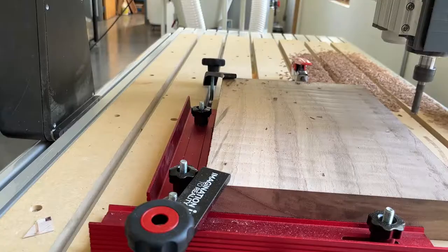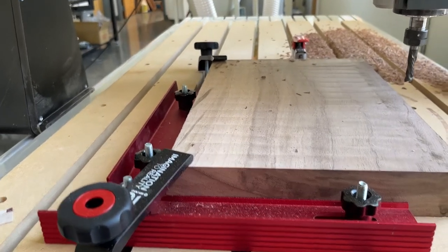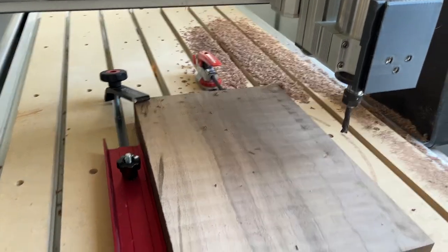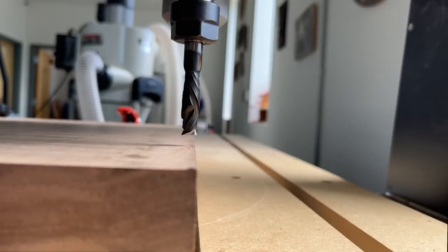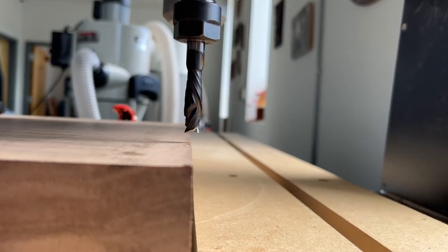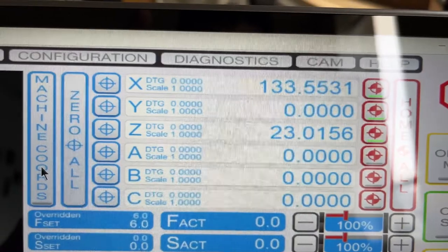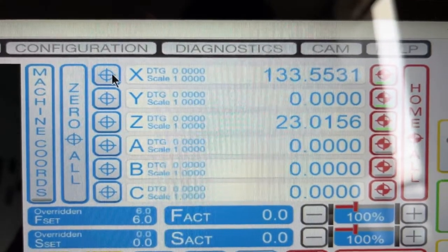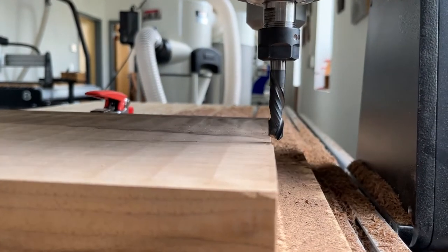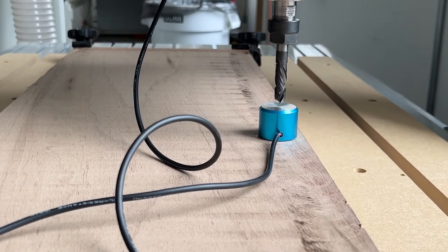Put the correct bit in your spindle and make sure your board is oriented so that the first side you're going to cut is exposed. Use your right angle fence to ensure the board is aligned. This time you can hold down the material with clamps so long as there are none on the side you are cutting. Then jog your spindle so that your bit is a little less than halfway over the edge of your material, and jog it along the edge of your board to make sure it will come in contact with every part of the side. Set that as your new zero point — Y-axis if you're cutting front to back, X-axis if you're cutting side to side. Do a border check to make sure your other axis center point is still aligned to the proper length of the board, then set your Z0 position before pressing cycle start.